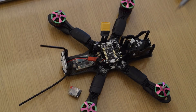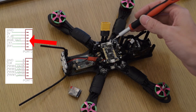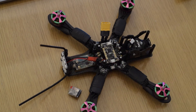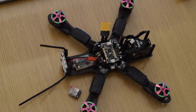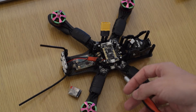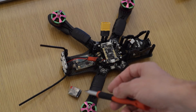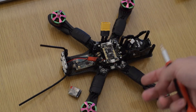To get the LEDs to work you need to take the third pin out of port 2 and run that down to your LED board. This is just one cheap one from Banggood — any LEDs would work, RGB LEDs. I also use the 5V and ground from the PDB on this side to power the LEDs. So I can't run a logger as well as LEDs at the same time; I just switch between when I want to.